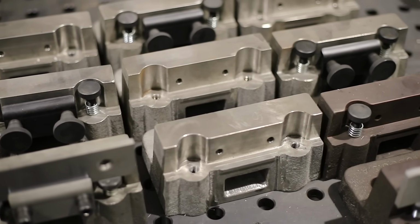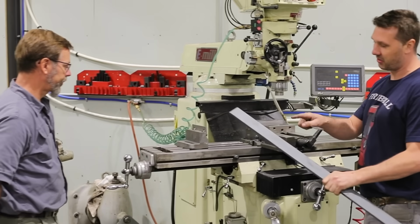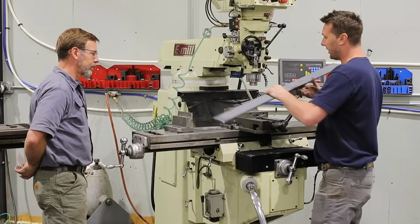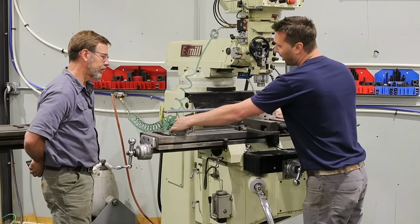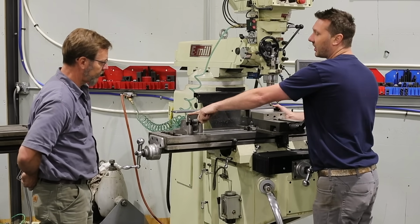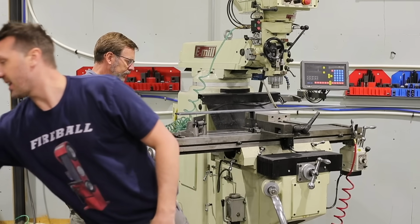So the idea and concept behind this is basically it's just a parallel jack. Let's say I wanted to drill a whole bunch of holes in this piece of bar, and you put it on a parallel. Let's say this is a 1-inch parallel to get it up to drill my holes. Well, I'm able to put this block and set these screws at the same elevation as the floor of my vise, and then drop the same parallel right into this block. And then I have a stand.